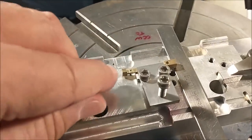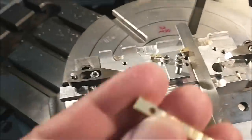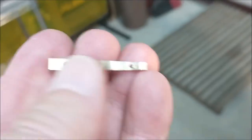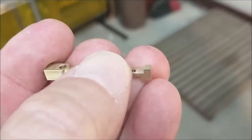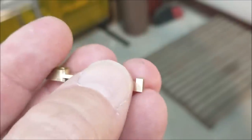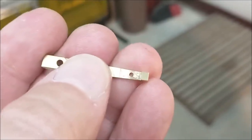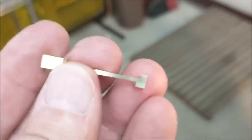And speaking of flex, I can tell you that when you put the angle on the part, down here by this little hole, you can look at the cross section of the material that remains. And that cross section of that material, it's considerably less than the surface contact of the cutter here. So you need to be real careful about that, or it will grab it and it will pick it up. Don't ask me how I know. I read it in a book somewhere.